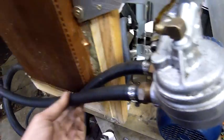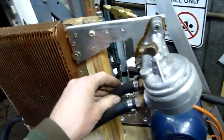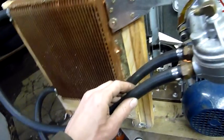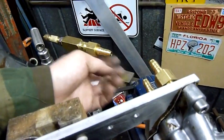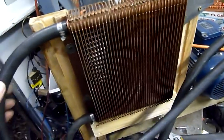This project's gone way into overkill mode but who cares - it's universal for various other projects. I haven't replaced these hoses because I don't have any half-inch cooler hose, only low-pressure heater hose. I had a look on Gates' website and they said don't use it for oil or pressure applications past about 50 psi. Whatever I've got in new stock is not adequate, so I've just shortened these and cut the nasty-looking ends off. The rest of them seem to be fine, so that'll do. I might replace them with a rigid line - just cut it to length, flare it and screw it in there.